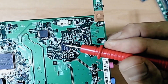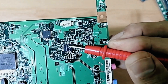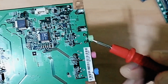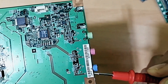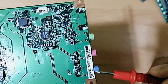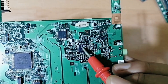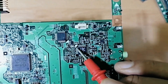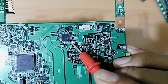This is basically the audio control IC that controls the audio connector. When you find those connectors or ports are not working, it means you have a problem with this IC. Here we have this hole and this mark, meaning we have pin number one, two, three, and so on. The same for this one — we have the marker.